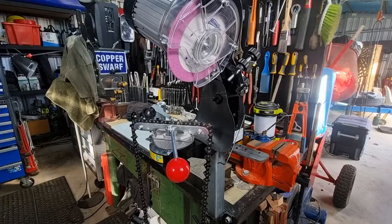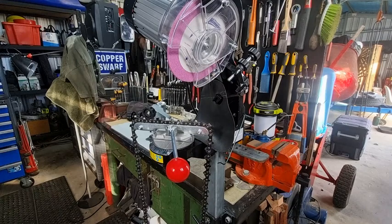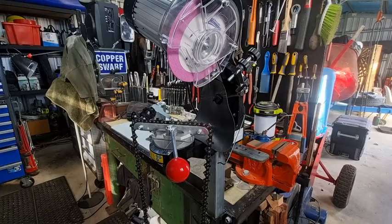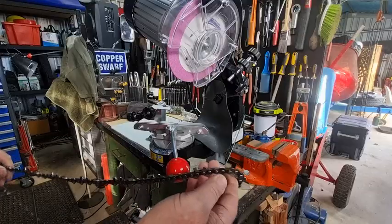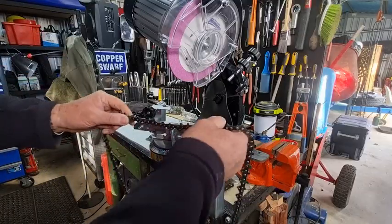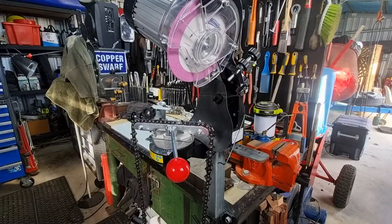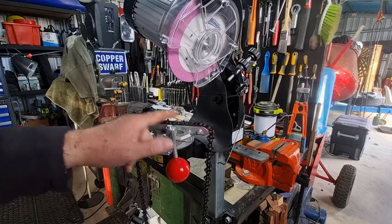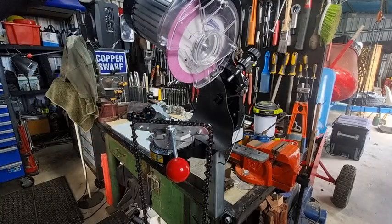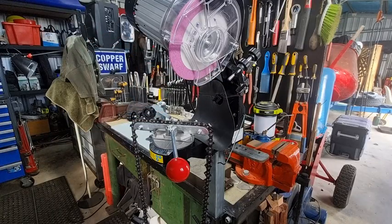The first thing you're going to do is set up your top plate angle and your top plate cutting angle, and make sure that you set your depth up as well. The next thing you need to do before you even start setting up the backstop is take your chain, have a good look at it, and try and find a tooth that's roughly the average length. So this is a 20-inch chain — there's 18 teeth per side. Out of those 18 teeth, you're looking for a tooth that looks like it's roughly the average length — not your shortest tooth, not your longest tooth. That's the tooth we're going to mark with a red texta.